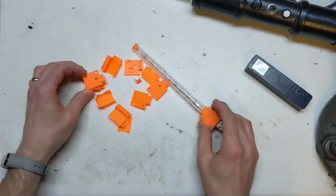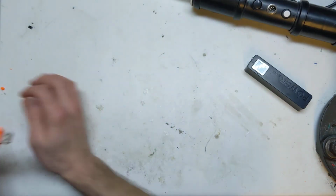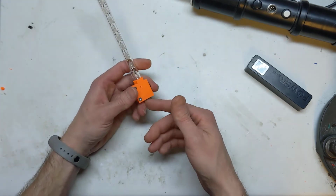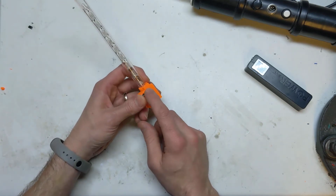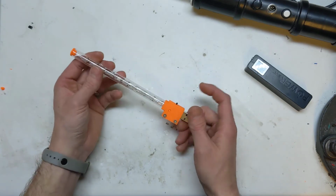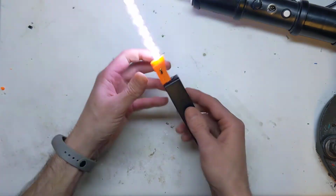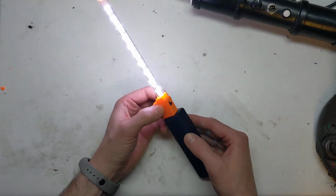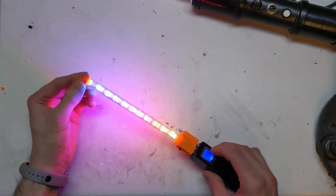And then I had a hole for the reset pin, because the way I did the code is you flip the switch, and then in the setup it checks which position the switch is in, and then sets the mode. You can't really have a button that changes the modes because of the timing issues with the library and so on. So I had a white one, and then you flick the switch, press the reset button, and it'll change to whatever that is, and then do it again. This is my favourite one, the rainbow one.